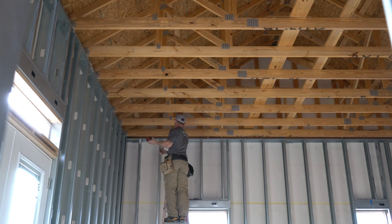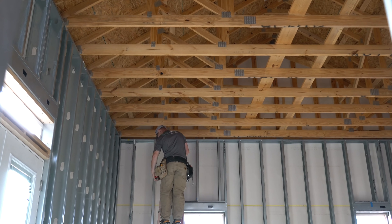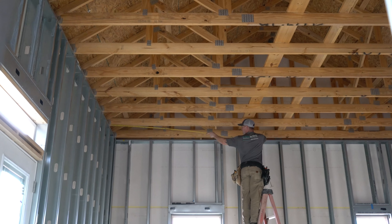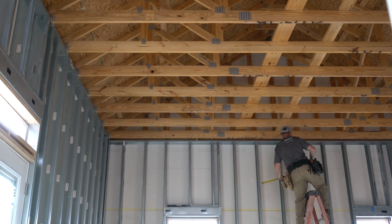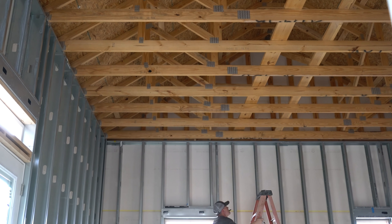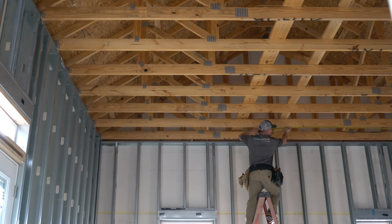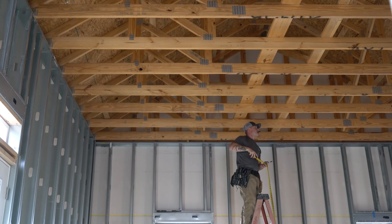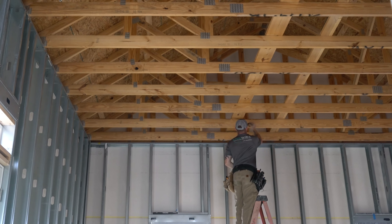Today the goal is to try to get the ceiling done. I want to get off ladders. When I do rough-ins, my first goal is to get all the ceiling done — get the ceiling cans done, all the lights, fans, everything. Let's start wiring up there and get everything up off the ladders so that the rest of the project we're just coasting on the ground, rather than going from groundwork to ceiling and back down. I always try to get the hottest stuff, the stuff up high, done first. This is all off 12-foot ceilings too, so I'm working on eight-foot ladders, just up and down throughout the day.